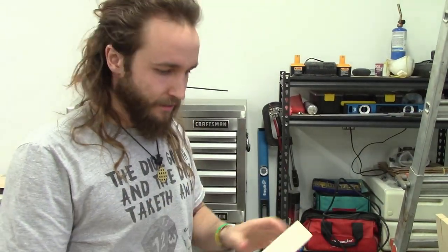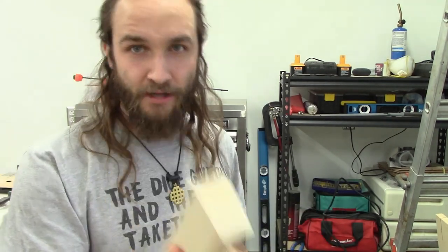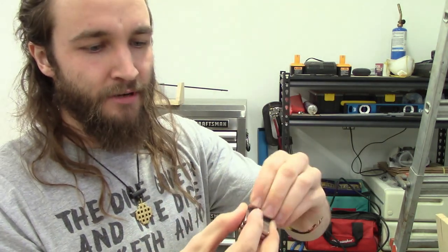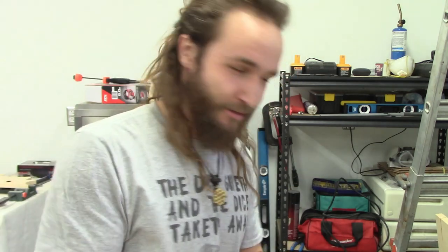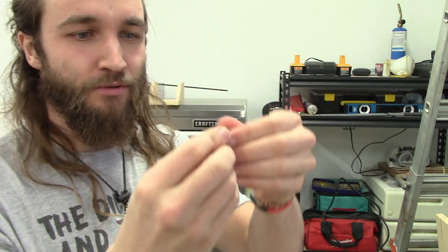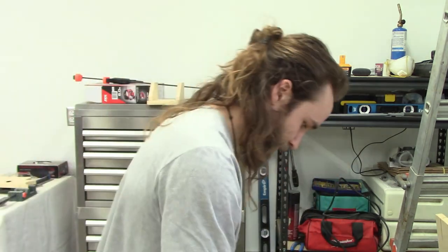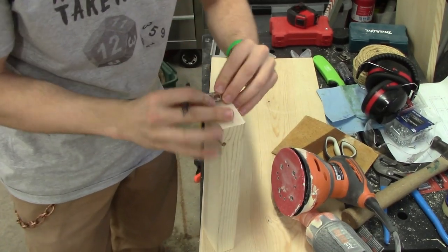Now I'm making the thing that grabs one board at a time. It's a one by three — one and a half by two and a half, because wood is stupid. I'm going to use these rectangle magnets, which will be more difficult to put into the wood but I'll use a chisel and stuff. I'm basically going to line this up with the wood and make a mark.